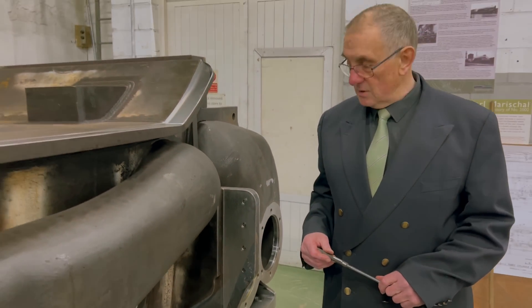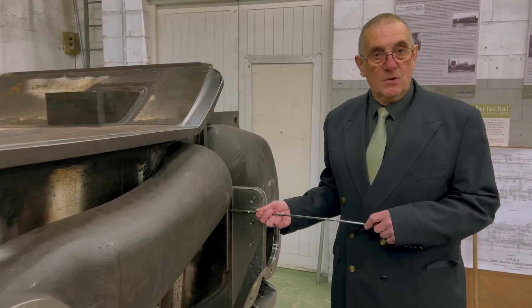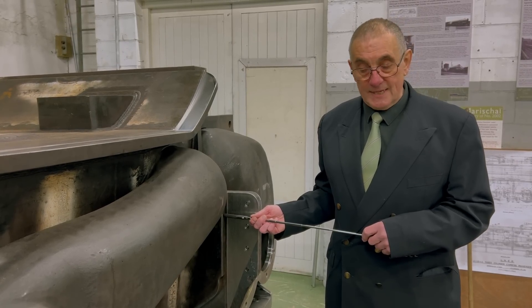and there is a similar one to the back at the front. When we finally lower the cylinder block onto the frame, there will be a small interference in these front and back bungs with the corresponding slot in the frames, as that will lock the cylinder block very firmly into place, in the right place.